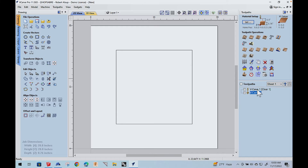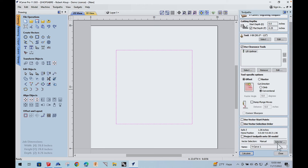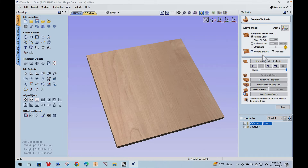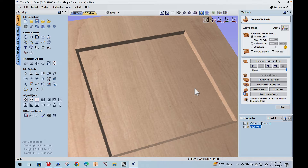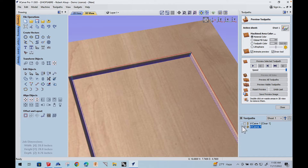For this demonstration I've got a 90-degree V-bit, and I said I'm going to use a clearance tool so that it creates a separate toolpath. Running in simulation, the first thing that happens is it cuts that pocket out — that's the first toolpath. Then the second toolpath uses the V-bit. You can see this is the 3D engraved path — if I turn that toolpath on, you'll see it actually comes up here and climbs out, and that's what gives you that inside cut.